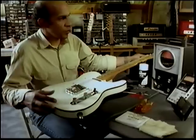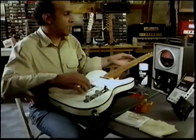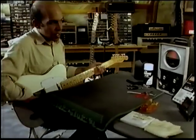And then move it, and you will see a drift. You can see the movement in the strobe tuner coincide with the movement on the guitar. That's the reason why you should never intonate your guitar while it's lying down. You should have it on your lap or standing up, just as if you were playing the guitar.